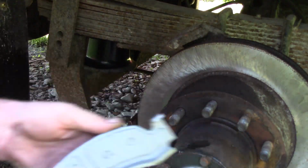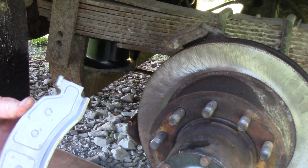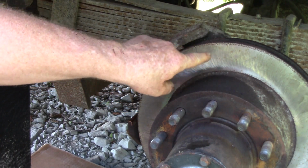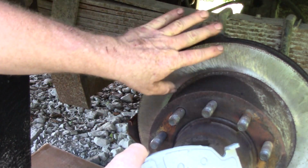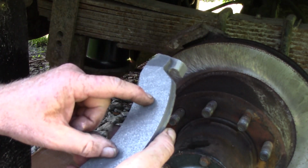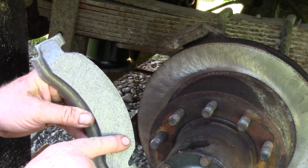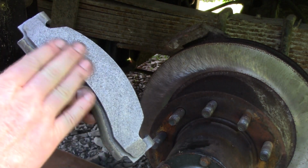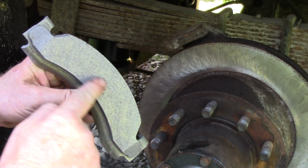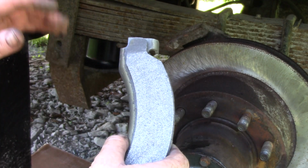Now, most brake pads like these will have a kind of anti-rattle area on them. If everything's done right, you'll see the crosshatch in that rotor surface. If that was super smooth, these will have a hard time breaking in, believe it or not. You want to have a little bit of a texture on there to break these in. And the reason is, and I've explained this to guys at work all the time, if you don't have that, it won't cut into this surface. This is rough. This isn't smooth at all. If that's really smooth and this is softer than that metal, you're going to have hot spots all over this brake pad, both of them. Because naturally you're going to put your foot on the floor and make it stop.